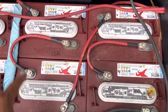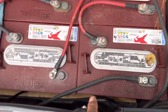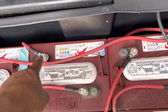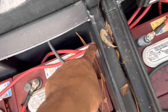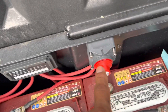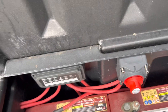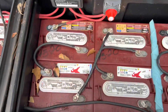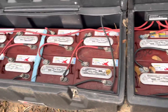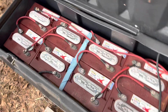Here's another battery - positive here and negative here. All negatives connect here and all positives connect here. I added a breaker that breaks the power from the positive side. If you want a better explanation of how those batteries are connected, you can look at my previous video.